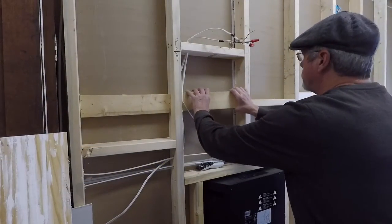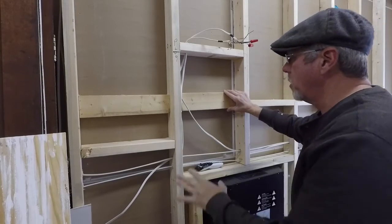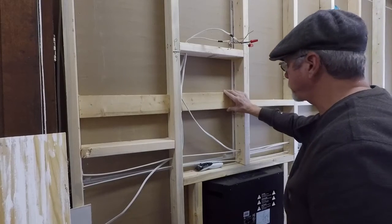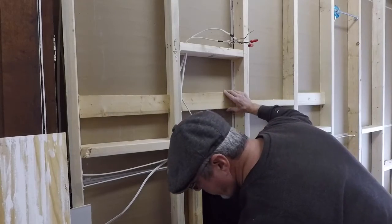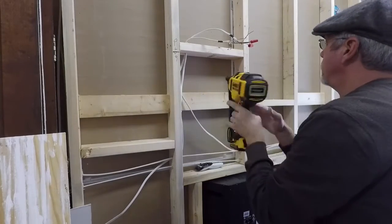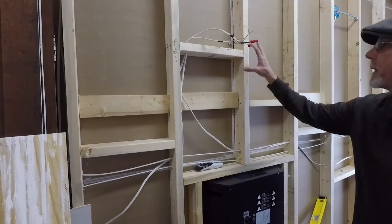And that's the reason I was leaving this back wall off — not putting the finish on the outside of this — so when the mantel came in, if I needed to put some more supports in for it, and to make sure I got all the TV cables around. They're down here and they're just going to come up. But this is going to be last, and the reason is for supports and what I need to add in, so that when we put the TV in I can get back here and mount the bracket for the TV and all that.